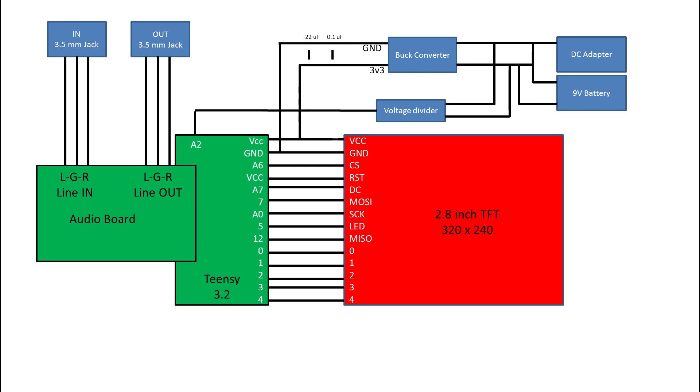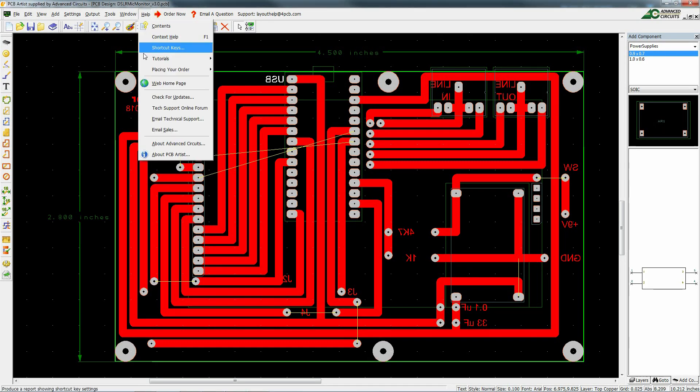Note: the classic pins used for the SPI display are going to be different. The audio board does take up some of those pins, but it's just a matter of connecting to something different. This unit is portable, so I can power it through a 9 volt battery, or if I'm inside, I can power it through an AC adapter. Everything goes through a buck converter, which converts the voltage down to 3.3 volts. I'm also monitoring the input voltage through a voltage divider, so I can see what the battery levels are during recordings.